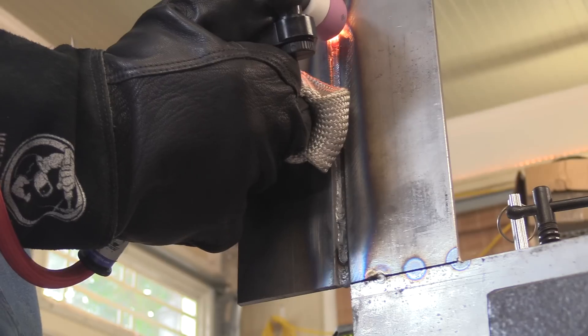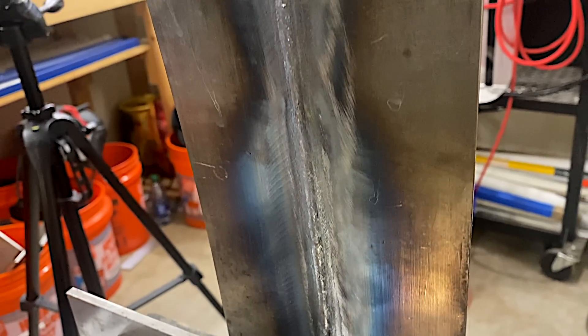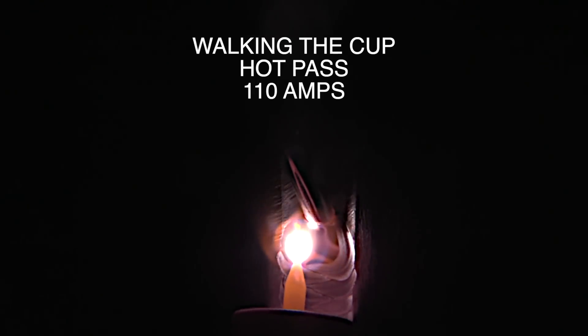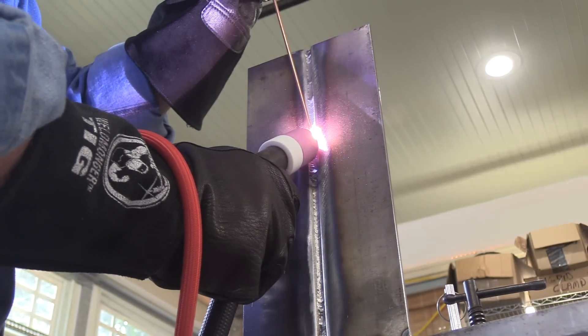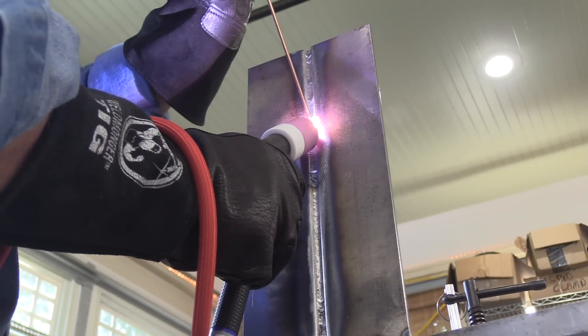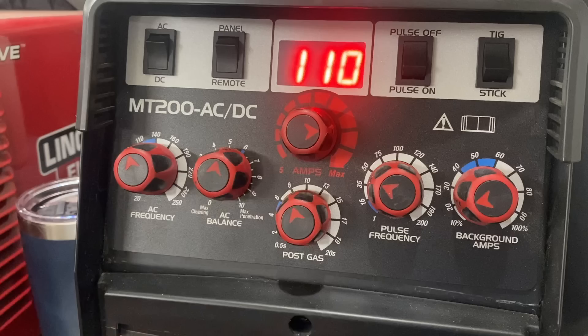I was on a job a long time ago and they practically insisted that you weld your root passes using that technique. Let's take a quick look at the root pass. We're going to put a hot pass in next — and oftentimes a hot pass isn't much hotter than the root. In this case I bumped it up 10 amps, which seems about right. I could have gone a little hotter but I'm a little rusty on this. If you go too hot and can't motor on out, you'll wind up melting through and sucking back, so 110 amps is working okay for me right now.